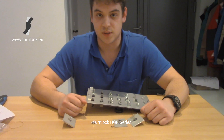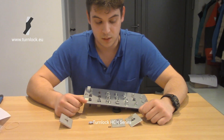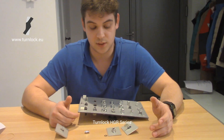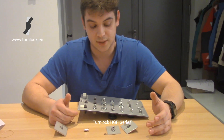Next, you can also choose if you want to use a zinc plated or a stainless steel type. Depending on your application, if you need a lot of corrosion resistance, you'll need a stainless steel stud. If you need a lot of tensile strength, you'll be better off with a zinc plated stud.